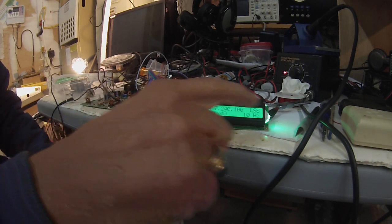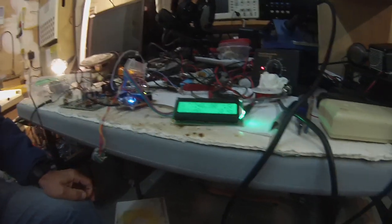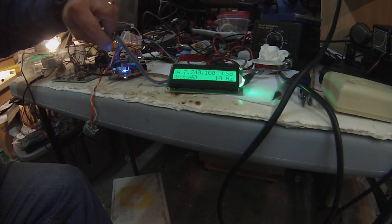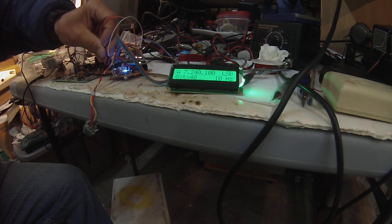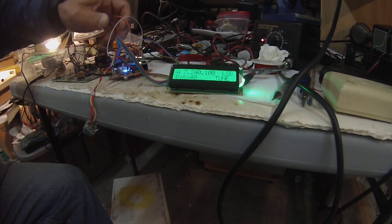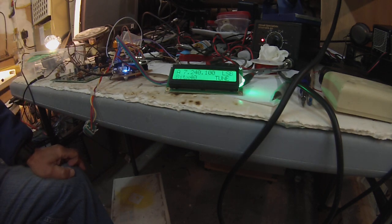This will have a tune function. If you put it in tune, the 10 hertz disappears, and the tune appears. You see tune appears there, and it produces a 988 hertz pulse tone for about 10 seconds. So you have a tune-up tone to go into the mic. There it goes back. And somehow the code is there, but it doesn't seem to be working.